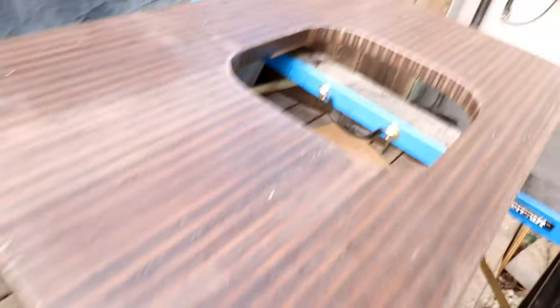Well, that's it for today. Tomorrow I might put an epoxy on, just a thin layer to cover up all the holes and everything. Just because there's something like that, there's a little crevice right here, a crevice right here, so you want to put on a very thin layer of epoxy first before you put on your flood coat, so it can fill in all these imperfections. I might do that tomorrow.